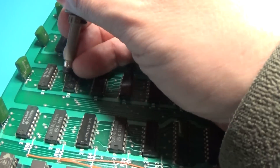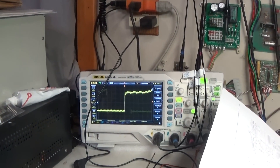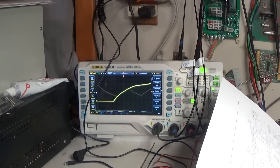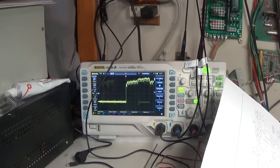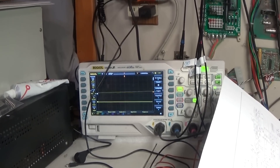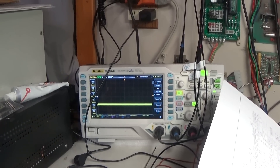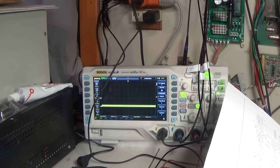They have something to do with the data going in. This 32 here - we have OR: that, or that. This is an OR gate, so we should definitely have some highs, right? And this is the output. The output is just low. That does not make logical sense.